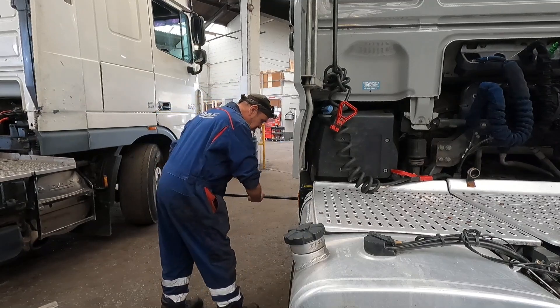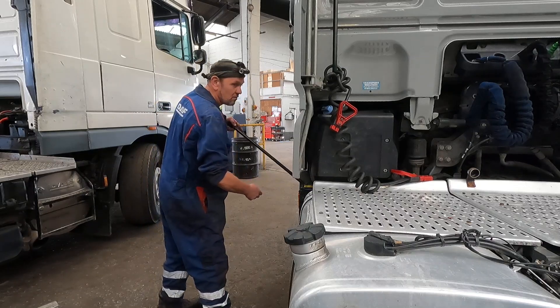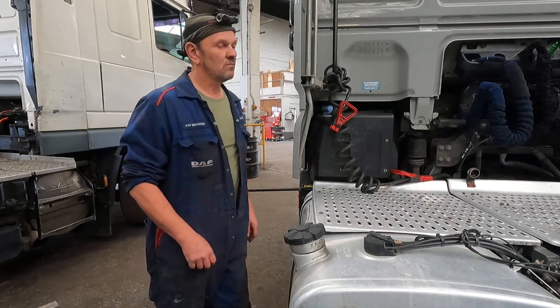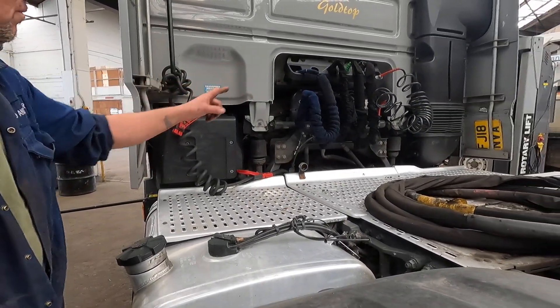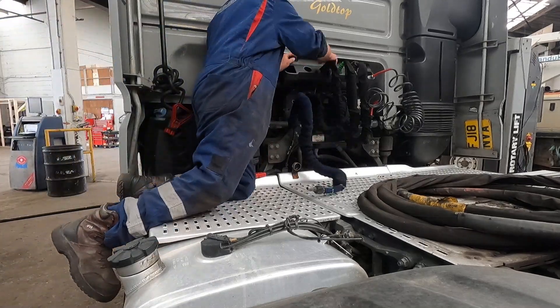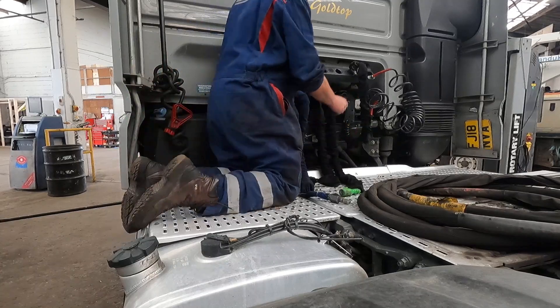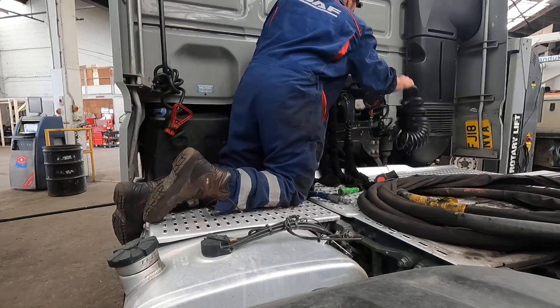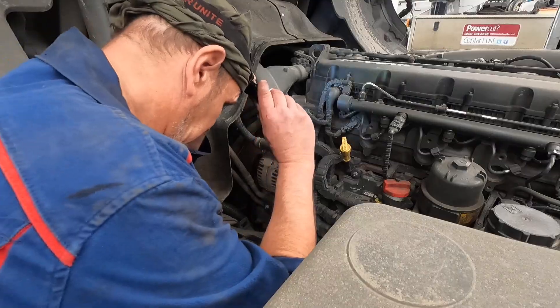I do know how to get the cab over on that. You turn that little gizmo there, then put the stick in, and then you pump it. The course told me if you take the Suzies out of the stowage, they won't get stressed as the cab goes over, so we'll take those out. I'm really never too much involved other than connecting and unconnecting the Suzies from trailers, but I like that — no tangle.